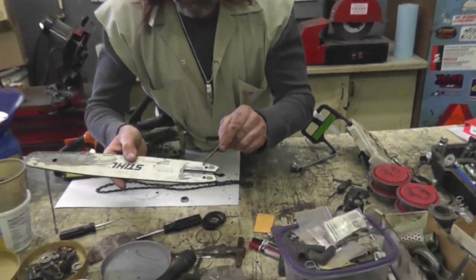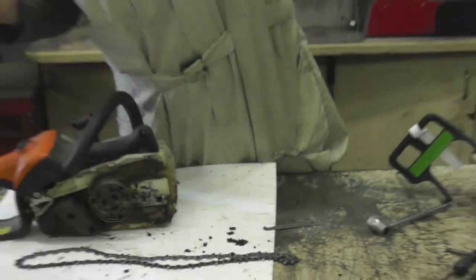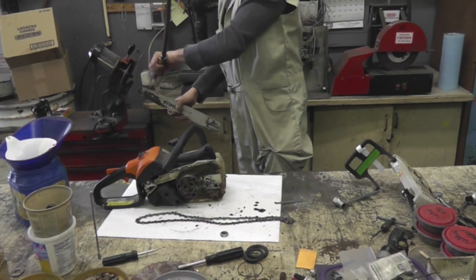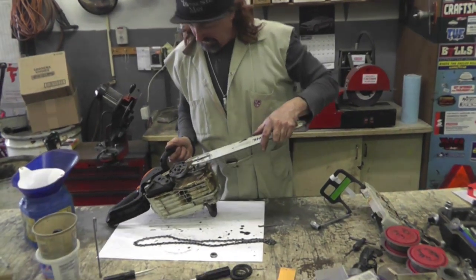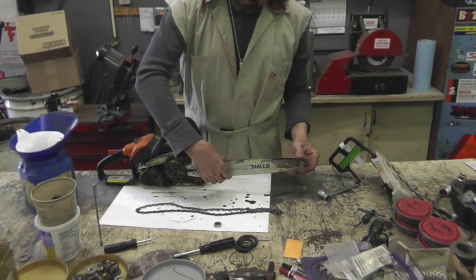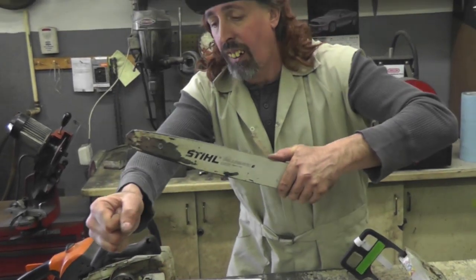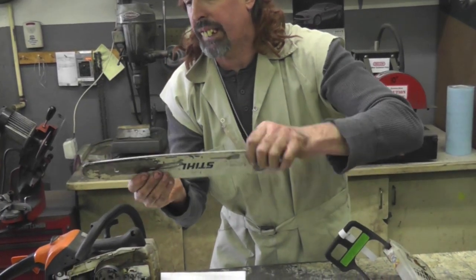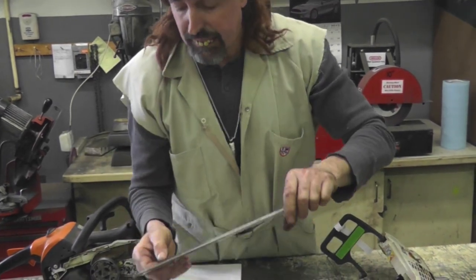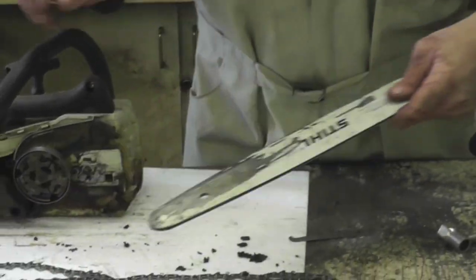Now there are little tiny holes in here — that's where the oil goes through. You need to make sure them are clean. If you've got an air compressor, blow it out. Just like a hot chick — you take care of your saw, she'll take care of you. Every time you put one on, because when you're cutting you're pushing and the chain is pushing out here, it's going to wear on one side. So if you keep flipping it, you're going to get even wear on that bar. You can tell this guy here ain't doing that — look at that, it's turned blue because it got hot, because they ain't getting oil on it and he ain't keeping it clean. You've got to keep it clean. And there's your dinner.